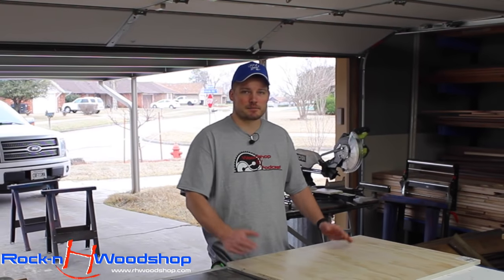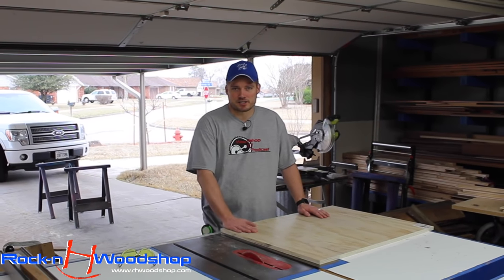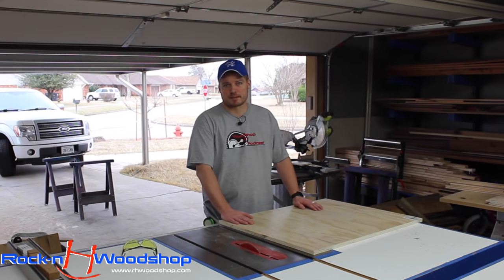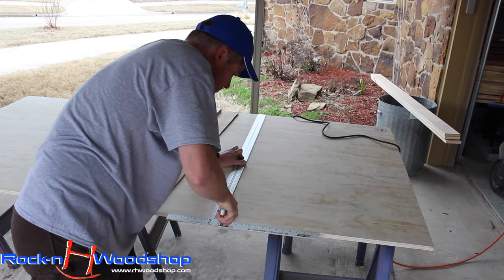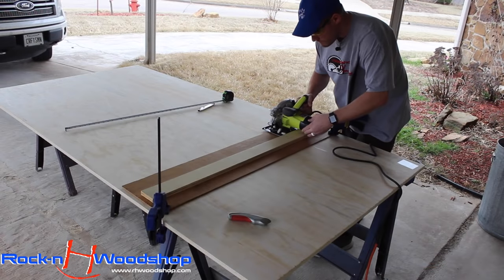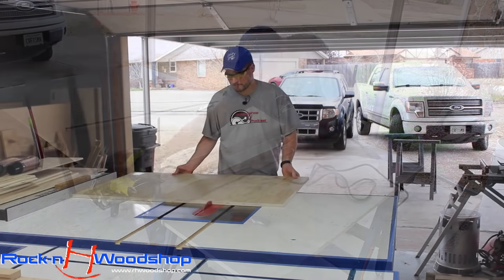Like any good tool, it requires a good foundation. That's why I'm making mine as big as I am. I've had one bigger in the past, but it got to be a little cumbersome to move around the shop, so I sized it down. I first break down a 4x8 sheet of plywood on a set of saw horses using my circular saw and a straight edge guide. I also score the cross grain to make sure that the splintering is kept down to a minimum.